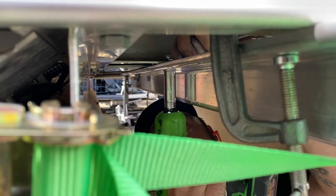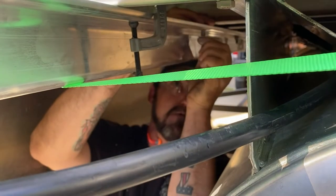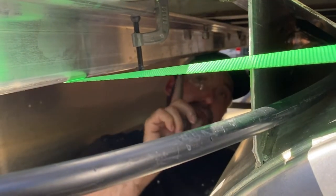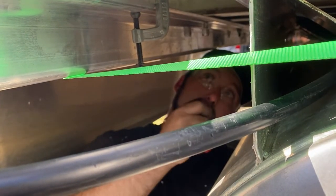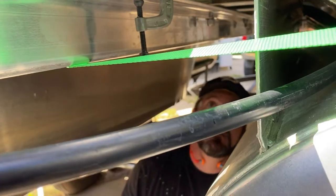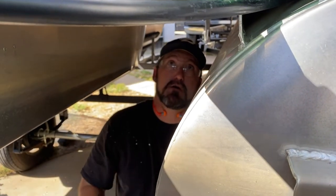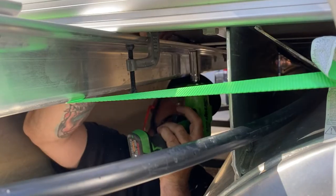Nothing like a little aluminum up the nostril. It can also be useful to have a center punch — if your drill bit starts walking back and forth when you're trying to get it centered, use a snap center punch to put a little indentation there to start your drill bit. I have one, but usually I do pretty well about not letting it walk. You do have to push pretty hard to drill up like that, so it can be a bit of a workout.